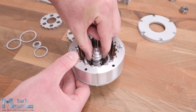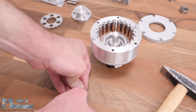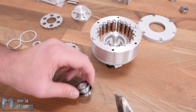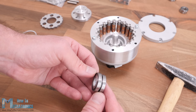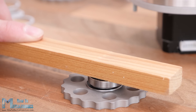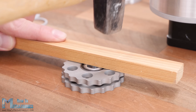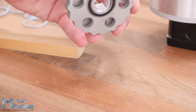The ring gear housing goes on top of the base plate, and first we need to insert a distance ring which will hold the output rollers in place. Next we can install the eccentric shaft, which goes on the NEMA 17 shaft coupler. Before installing it, we need to insert two bearings with 17 mm inner and 26 mm outer diameter. I set the tolerances where the bearings go to be an interference fit so the bearings stay firmly in place — that's why I had to use some force to insert them. This assembly represents the eccentric bearing.